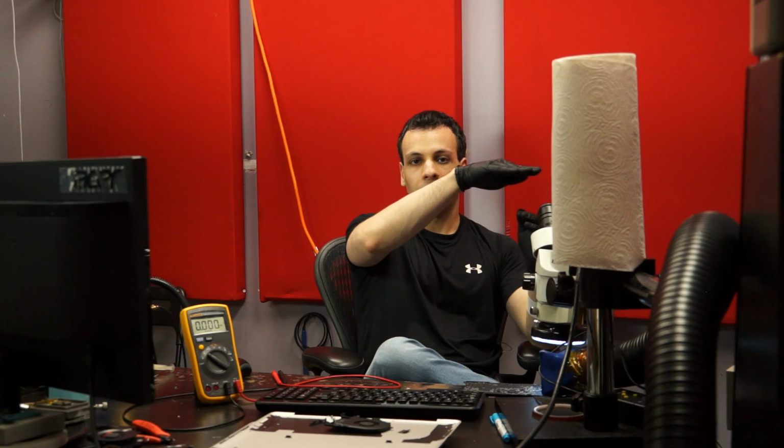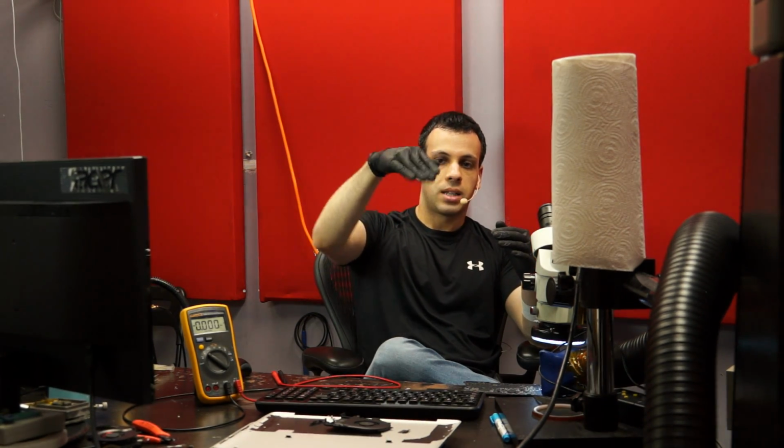Yes, so there's going to be a chip that sits in between the SMC and the chip that creates PP3V42. The entire purpose of this is that the chip that sits in between is going to say, okay, I'm going to wait for 3.42 volts to stabilize and be a nice flat voltage instead of a fluctuating mess. And then once that has stabilized, I will release the SMC reset signal and allow the SMC to turn on.